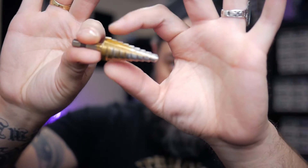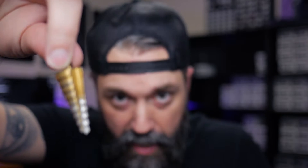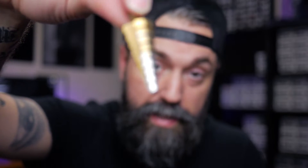Another really helpful tool is step drill bits. They have a bunch of different size holes you can drill with them. You kind of get the hang of it — like two steps down is your potentiometers, or three steps down is your jack. These are really helpful tools that make fast work out of drilling.